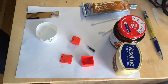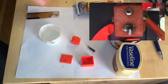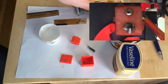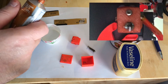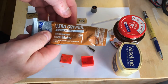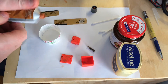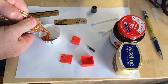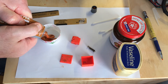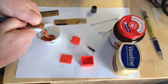Alright, we're going to do a little video on making a heat block sock. You've seen them — they come in blue usually from E3D. They make their own. Now we're going to use this ultra-copper gasket-making silicone. It's a super high temperature. Squeeze out a bunch — you're going to want a good amount, more than you would normally think.